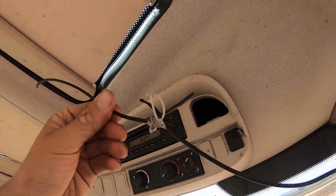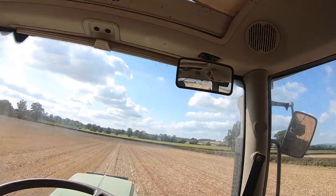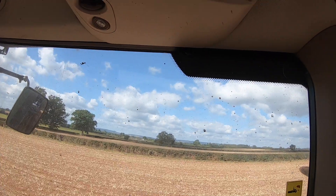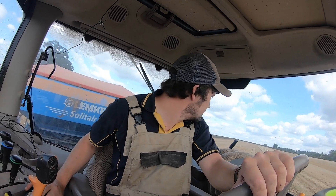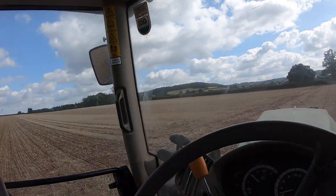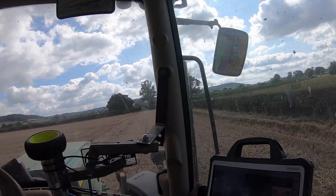Did have a bit of a hiccup — caught that in the latch last night and I was worried I'd lost GPS signal, so that's going to have to be rectified at some point. But we're getting on — we have RTK, doing a very nice job, and I'm not having to steer. I actually used the AB lines from when I was in here cultivating the other day, going up and down the field — the straight AB line and also the AB curve that I put in doing the headlands. That worked really well. You can see up across there, lovely straight lines. This setup looks so Heath Robinson and rough and ready — it's amazing how good a job it does. Very happy with it.